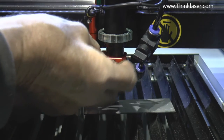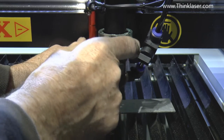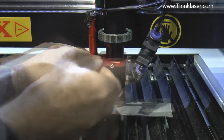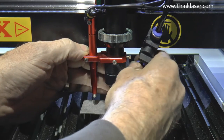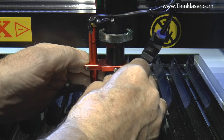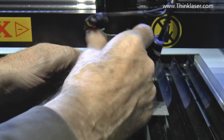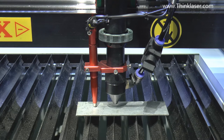What we're going to do now is drop the pen down. At all times you can undo these screws — I've got these done up finger tight because I don't want to risk stripping the threads. The correct setting position for this is down on its collar. That's now secure and not moving around. What we're going to try to do is drop this down to get the sensor to just about touch the surface — not trying to make the switch, just get it within half a millimeter or a millimeter of the surface — then tighten and lock it. Then we'll go back and try the autofocus.